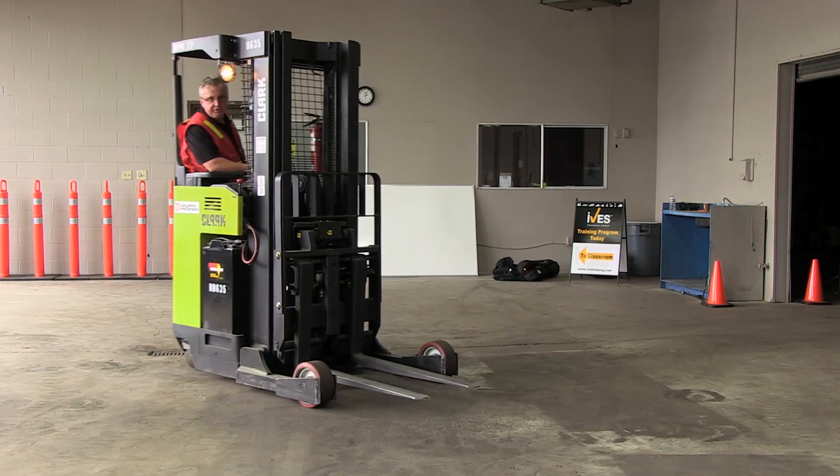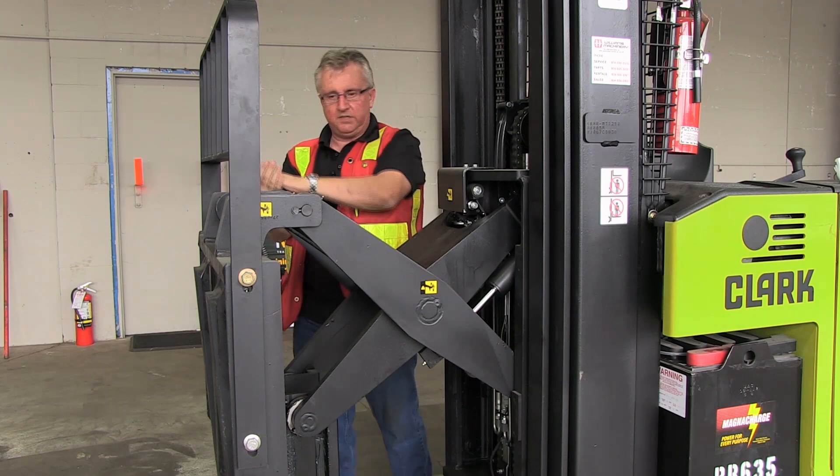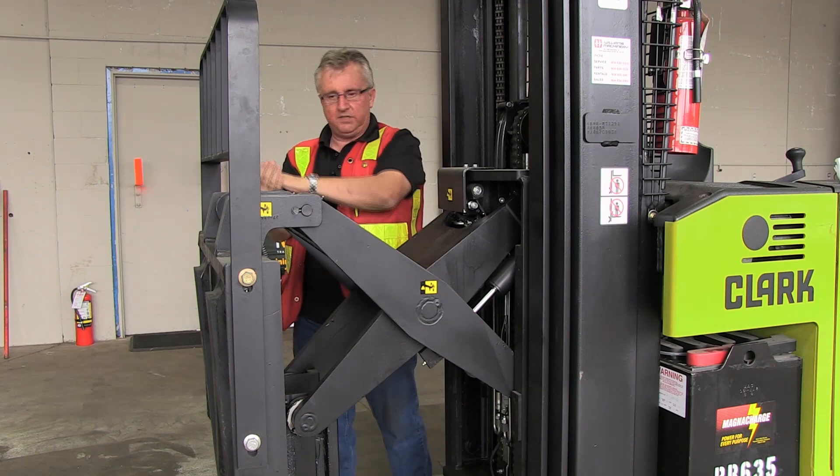Notice it's turning so tight that one wheel is going forward while the other is actually going in reverse. If you're extended — say backing out of a rack and turning — and you catch the fork or something like that, any kind of sideways stress on this mechanism almost immediately bends things, cracks things, and damages things.